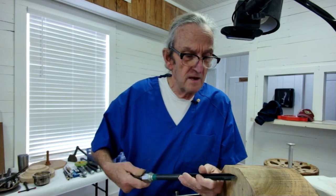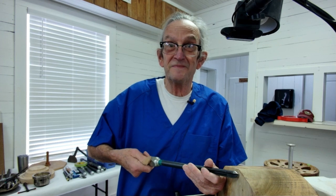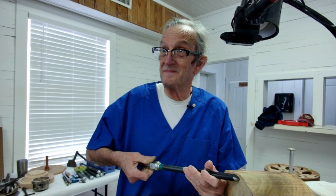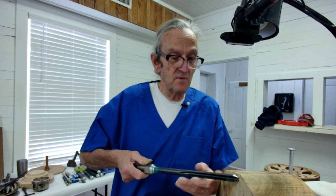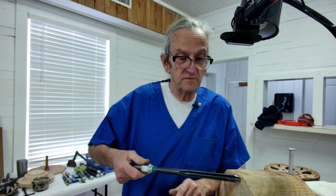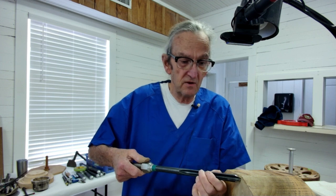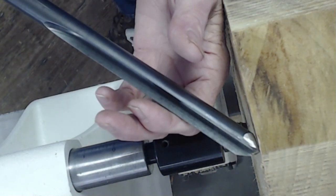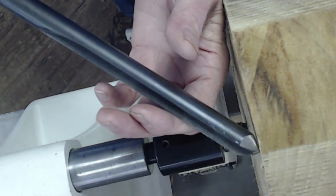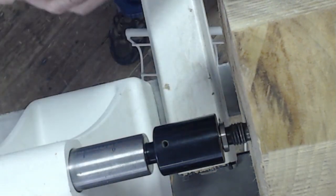Look what happens to my hand on this at 40 degrees. I don't change anything. When I swing it up and I'm cutting this way with it almost vertical, I get a cleaner cut. So if you get into wood that's real punky, that'll cut. But I normally cut it about 45 degrees across. I can normally get a real good cut on that. But that's another advantage of that tool, just being able to rotate that. I want to slow the cut down or peel more wood off.